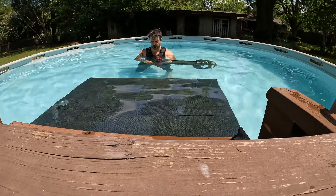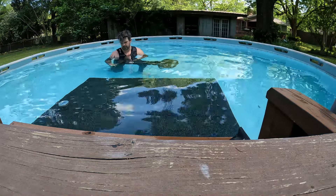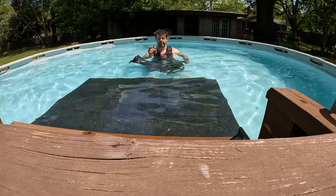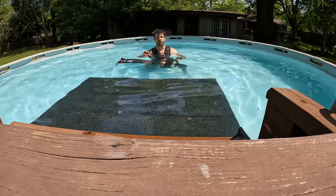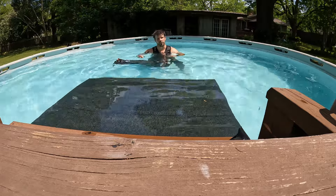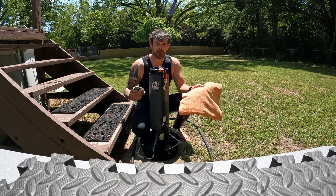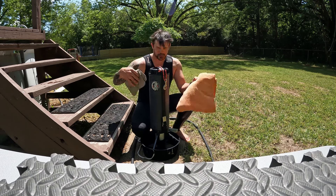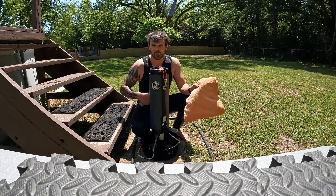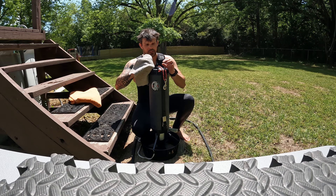So shouldn't take too much here, but we're going to see what happens. We narrowed it down — we know we need about this much weight to put into the nose cone. We have some lead shot left over from tinkering around with some other DPVs and we're going to use this to replicate this weight and put it into the nose cap. Then we'll come back and do another in-water test. This is why it's important to have the towel and the rag — because whenever I pull the cap off of this, I want it to be dry so that water doesn't get down into the body of the tube and possibly down where the battery connectors and circuit boards for the motor controls are. You don't want water and stuff in there. So that's why it's important to have towels and rags — something to keep things dry and clean.